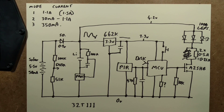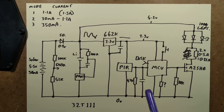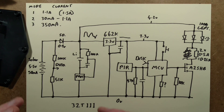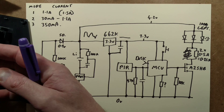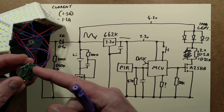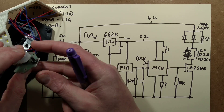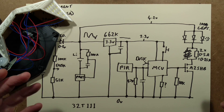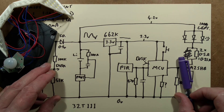So there we go. It's interesting — it is proper textbook design. I'm going to remove one of those resistors and put this back together, and I'll let you know the capacity of that cell once it's finished charging. I'm going to make a wild guess that it's going to be 1 amp hour, as many of them are. It seems nicely made but it's completely not waterproof — water will probably get in and it will die. You can make these things more waterproof by using lacquer or spraying some sort of oil or coating, being careful not to get it on the PIR window because that can affect its ability to see heat. That switch will probably corrode too. These things are not designed with longevity in mind, but it's a good basis for working on and adapting — even if just to buy the circuit board module and use it as a controller for your own lighting. Interesting little circuit.